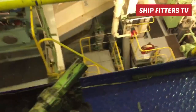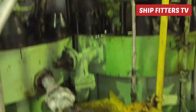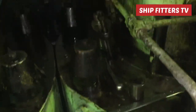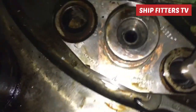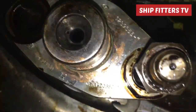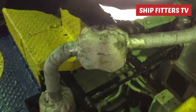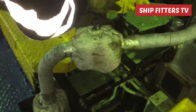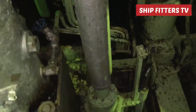After finishing boxing up, we must put back this high pressure pipe into position. We inspect the fuel valve seating and confirm it is in good condition. Now we must put back the high pressure pipe. After putting it back, close the drain valve and open the inlet valve.